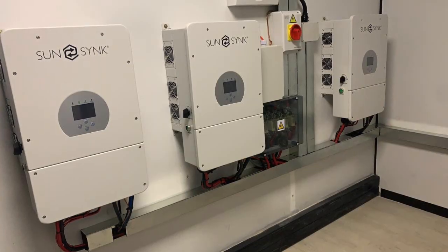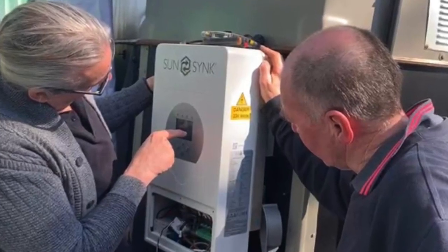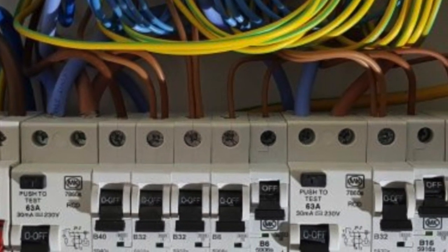But you can't simply connect the battery directly to the mains — you have to use a device called an inverter. The inverter is the device that connects between the battery and the AC. The AC can charge the battery, either directly from the power or from a solar panel, and when you want to use the power it will discharge from the battery. We often refer to AC coupled — it very simply means the inverter connects directly to the AC, the power doesn't flow through the inverter, so you just connect the inverter to one of the fuse boards.